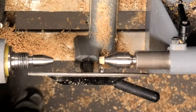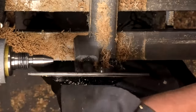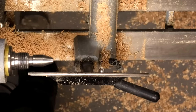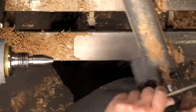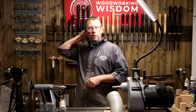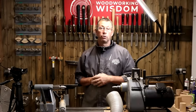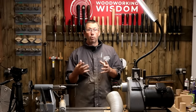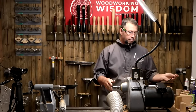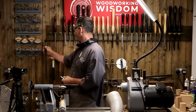Yes, Ben, you got a question? Yeah, we've got a couple of questions in. First one from Jim. He says he's planning to buff and carnauba wax a project. Should he start with a sanding sealer or straight onto the raw wood? Sanding sealer, always. So put your sanding sealer on, wait for it to set, lightly denib, and then you can start putting on the wax. And then Matthew's asking for the best wood finishing product, but I guess there's lots that you could choose from depending on what you're doing.